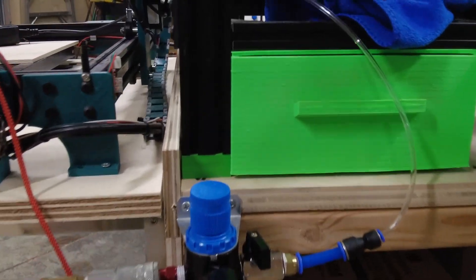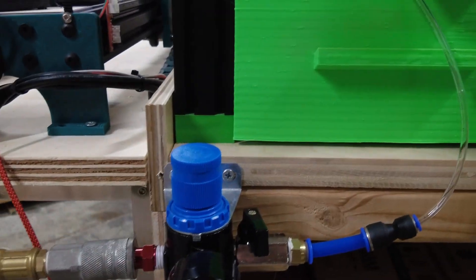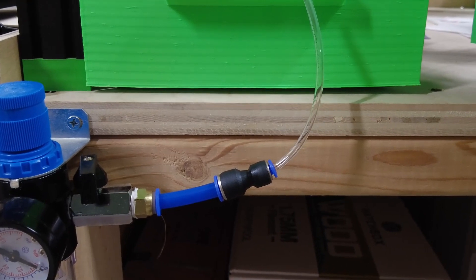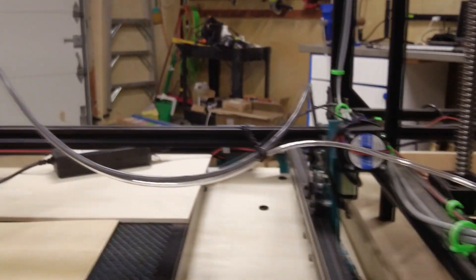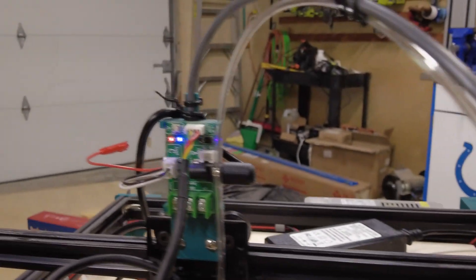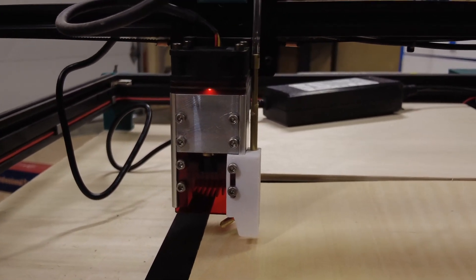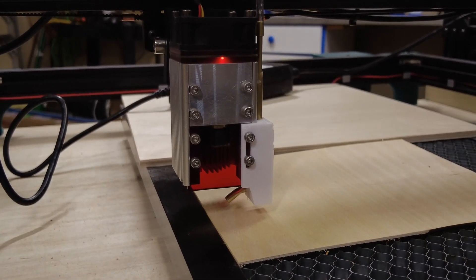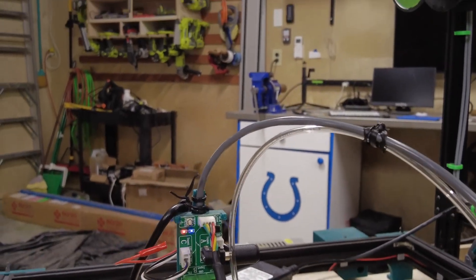I have hanging off of that this little air valve that allows me to turn the air on and off as I need. Then it's an 8 millimeter to 4 millimeter adapter — I just happened to have these parts. This is a 4 millimeter outside diameter tube going over to the head. I made a little bracket to attach the tube — just a homemade setup for the purpose of this test. The newer versions of these have an air assist built in, and I'll link to that as well. But that's the air assist setup — pretty easy.